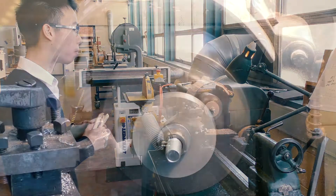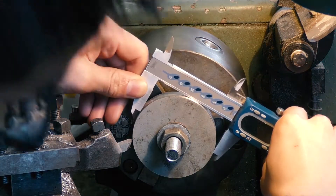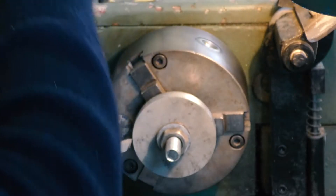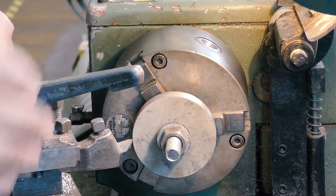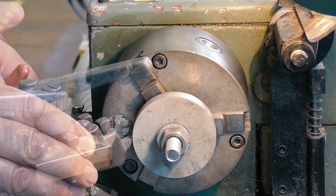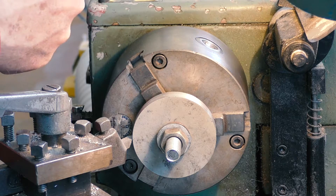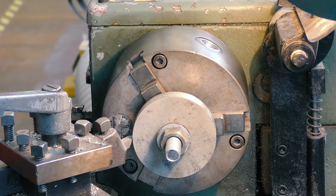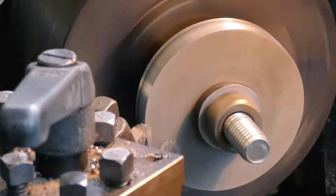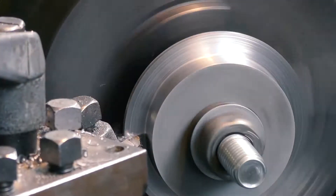The idea is to keep taking cuts to get the depth pretty right, and then with the last cut go a little bit further to square out the corner. I'm turning the step just like on the previous one. This took days to turn mainly because I only had lunch time to do it, but the lovely metal shavings coming off gave me the motivation to keep going.